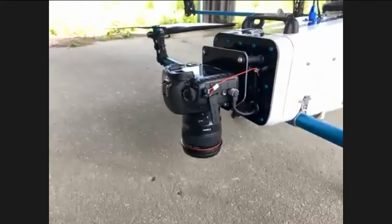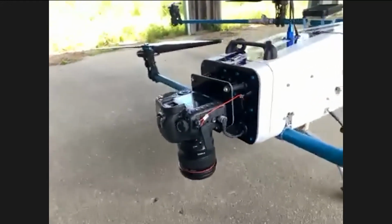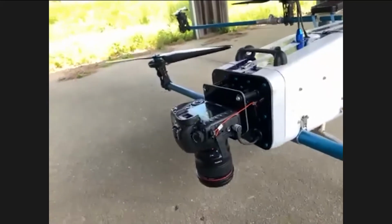I forget the exact model number, but it's the 51 megapixel Canon camera. Like you can just buy on bnhphoto.com or wherever you want. It's the high-end professional DSLR camera from Canon, 51 megapixels. The lens on it, we selected a 24 millimeter lens that's rated for low optical distortion. It's a prime lens. There's no zoom on it. And it's better for photogrammetry to not have a zoom lens and to have a low distortion rating, especially out towards the edges. Oh. The camera is looking at me instead of the camera. Yeah, so this is just a prime lens on it, 24 millimeter. So that's the camera. Say again the next question, I'm sorry.